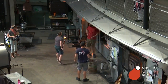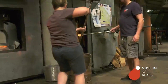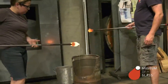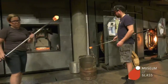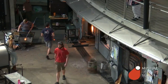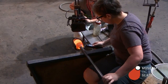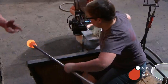And here we go. That's the first layer of molten glass on that surface. Remember that we only have a thin layer of color, but the molten glass on the surface has the property of magnification and will make the whole piece look like it's a solid color. When we're making something here in the hot shop, we always layer the glass, which means if we're gonna make something large or big, we will just be taking multiple dips in our furnace.